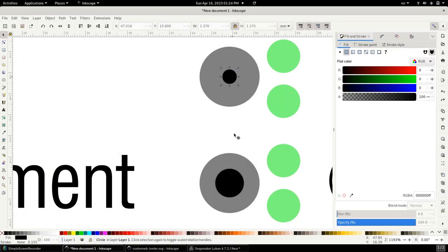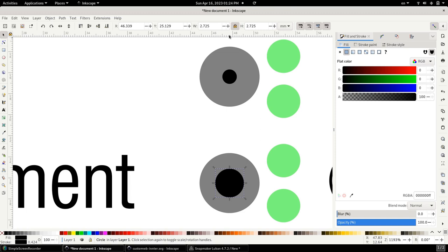This workaround is especially useful when hole sizes are smaller; for larger sizes, STL or grayscale SVG relief carving might work better. Now let's look at measuring the positions of each hole — the most important part. If measurements are wrong, the whole board gets screwed up and you have to start from scratch. The method: measure the distance between the outer edges of two circles, then subtract the radius of each circle to get the center-to-center distance.